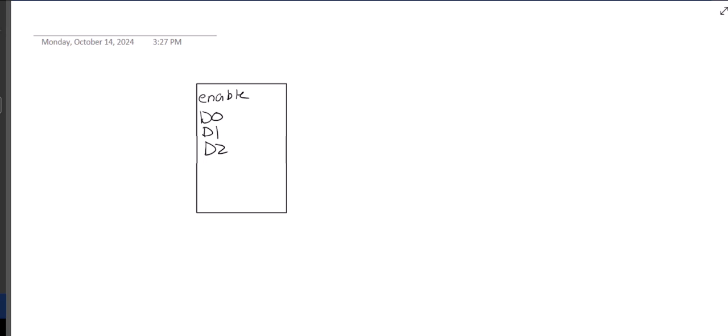And so you can assume your counter works, and it's however many bits it says it is. Your homework problem has a 4-bit one, but you'll see how to do it if I do just a 3-bit one. So it has an enable, and then it'll have 3 inputs, and a synchronous counter is most likely going to be made from D flip-flops. That's why they're called D, but you don't have to worry about how it's made. And you have a load, and you have a clock, and you have your outputs, and you'll have as many outputs as you have inputs.